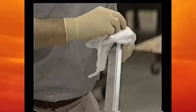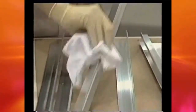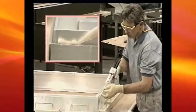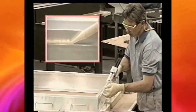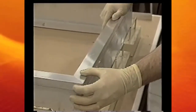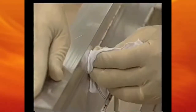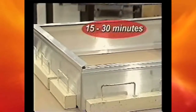15 to 30 minutes. Should the assembly require retainers, wipe the bond surface of each part with an isopropyl alcohol dampened rag. Apply a bead of Lord 406-19 to 3 sides of the sign frame where the retainers will be attached. Position the retainers in place and wipe off excess adhesive. Allow the undisturbed retainers and assembly to develop handling strength for 15 to 30 minutes.